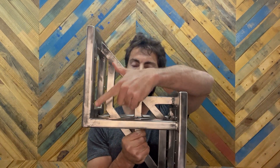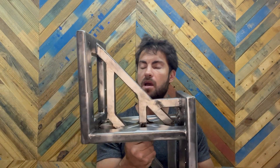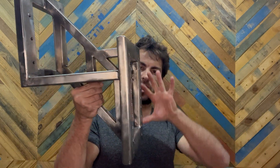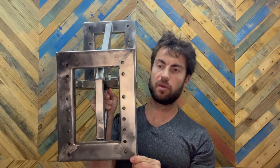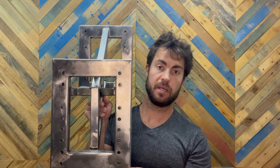Now that this bracket is done, let me explain how this is going to work. We have this part of the bracket which has the same hole setup as the Panther Outboard Motor Bracket. This portion is going to mount to the back of the boat, and then I have several supporting beams that go along to distribute the pressure of this bracket. Then I made a larger second portion which is going to mount the Panther Motor to this point. The reason there are so many holes in here is I gave myself a little bit of leeway in case I have to adjust that bracket again — this way I have several inches of adjustment to give me the drop that I need to mount that motor.